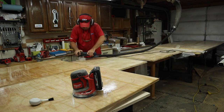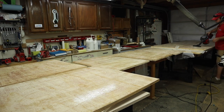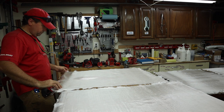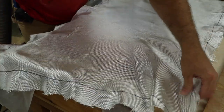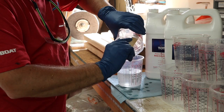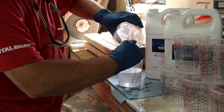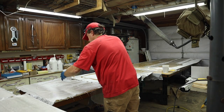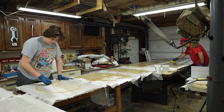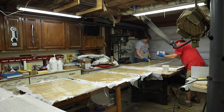That process includes a specific resin-rich mixture of epoxy resin to hardener, along with very thorough mixing, which includes a two-pot mixing method. We need to make sure that all the hardener is used up in the chemical reaction that creates that inert plastic that epoxy becomes. Once the epoxy has cured past the green phase, where you can't dent it with your thumbnail, it also requires some post-cure heating. That means the surface of the epoxy panel needs to be heated up above 120 degrees and held there for 4 to 6 hours.